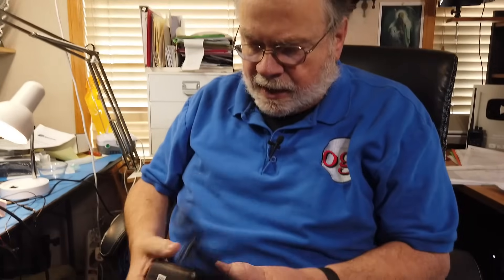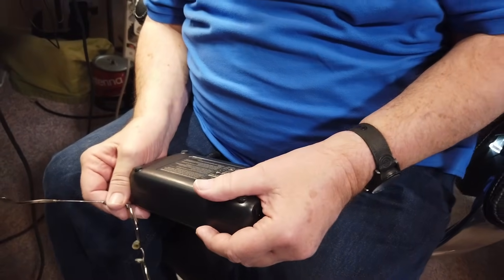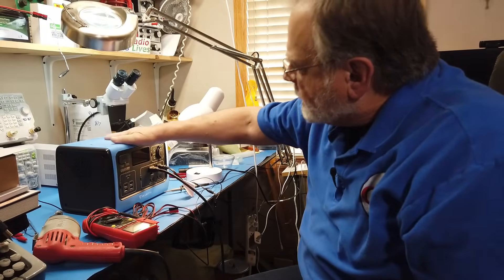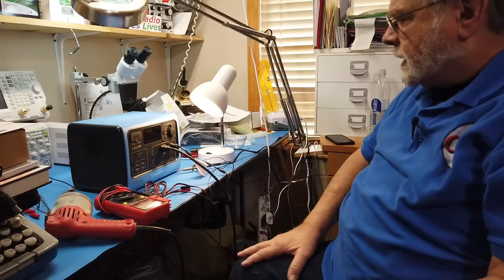You're going to have to use a 12-volt panel whose open-circuit voltage is not greater than 28 volts. The adapter is designed for 25 to 28 volts, and this monster adapter puts out 25.2 volts at 0.8 amps — not very much, so it's unclear why it's so big and heavy. The extra cables come loose in the box rather than in a nice zippered pouch like the other unit. This does have the wireless phone charger on top and a bigger light out the back.